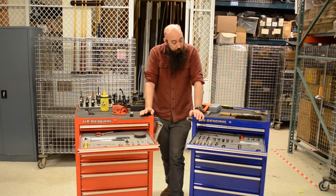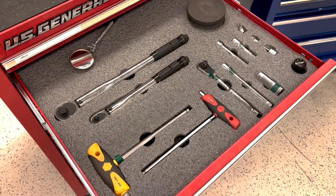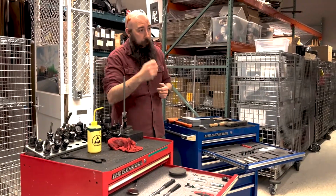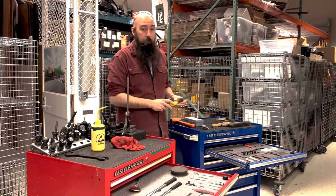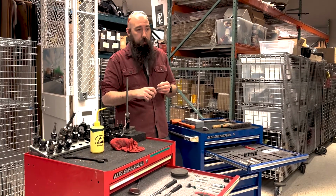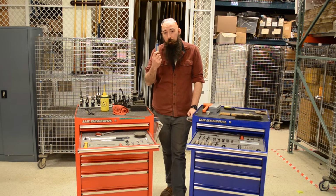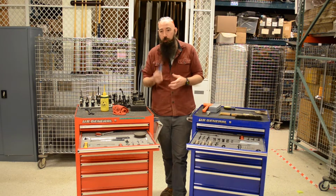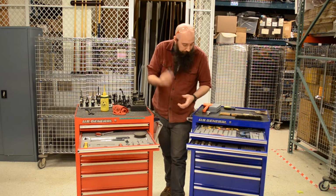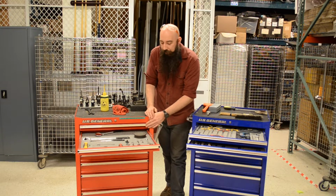Some other lovely tools. Well, actually, we'll talk about deburring as well. So when you're done with your part, so this is a post-process part, often you'll have a really sharp corner that might need to be knocked down. Old school, just use a file. They're super helpful for everything. But deburring tools in general just do the job quicker and a little bit safer. You can get a whole huge variety of different tips for different applications. These things are lifesavers. Buy the whole kit if you can, or buy the size that's necessary for what you're doing, and then buy the additional little heads.